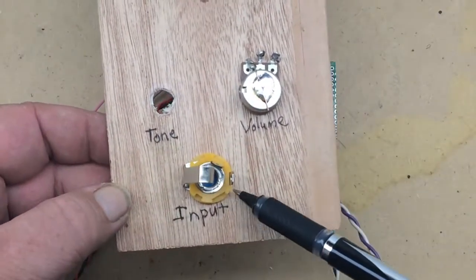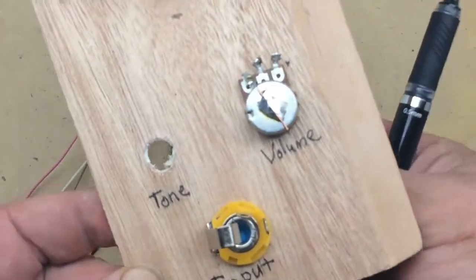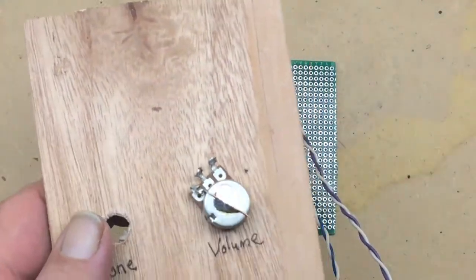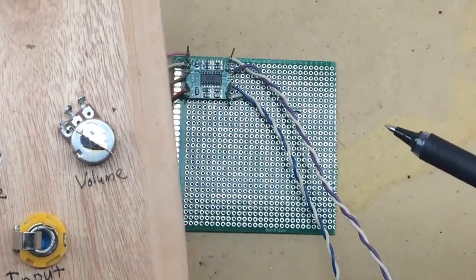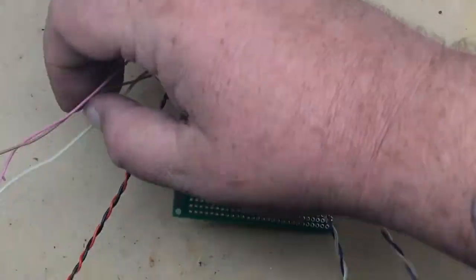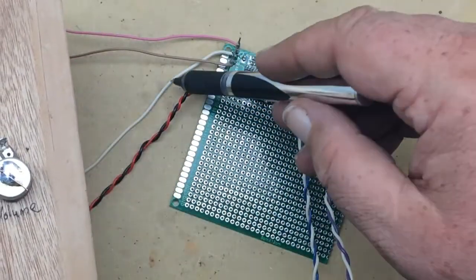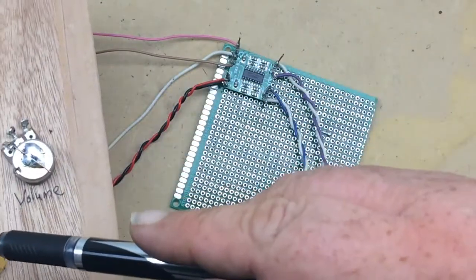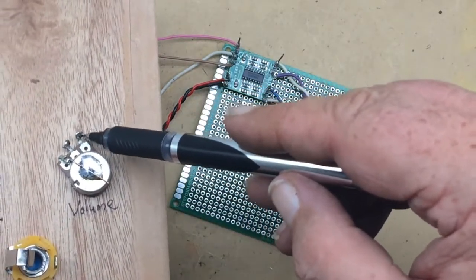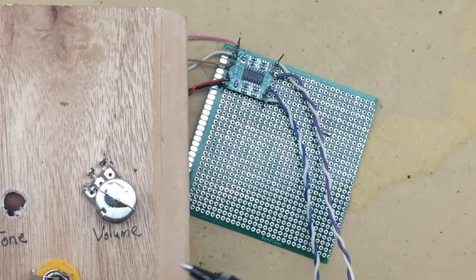Now, in this instance I'm going to use the guitar jack for input, but you could easily use a 3.5mm — I just use an adapter and pop that into my jack. Remember, we're going to be putting the volume control before the amplifier. So we're going to have to tie, in this case, the tan and the pink together as our inputs, which will both come out of the center lug. Our ground will just be grounded to the back of the pot. The tip will be the input to the right lug for the volume. I'm also going to hook up the speakers so we can give you a demonstration of it in action.